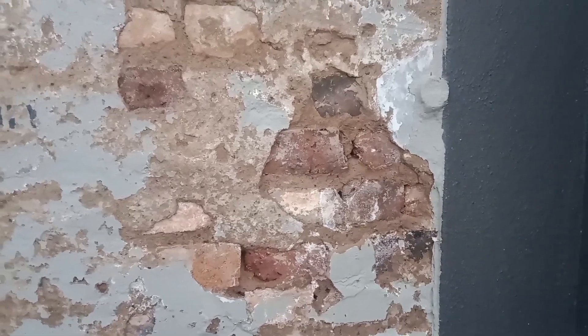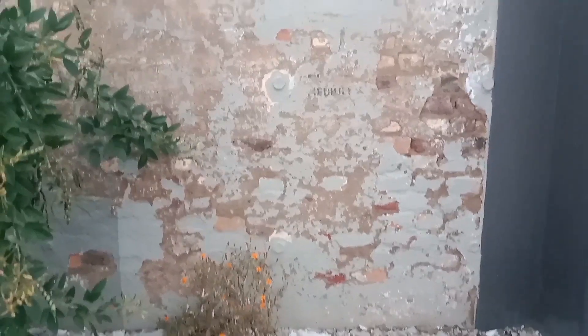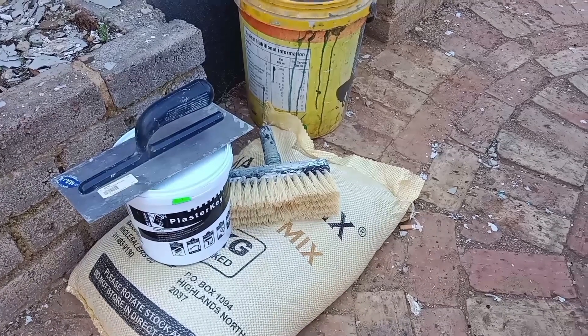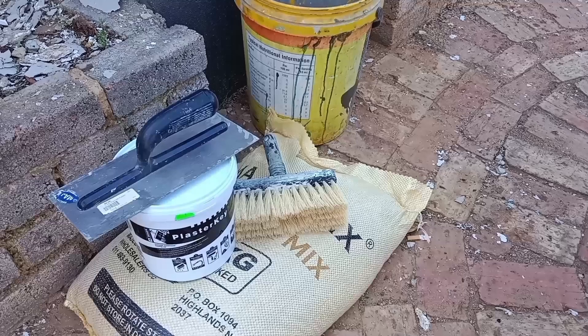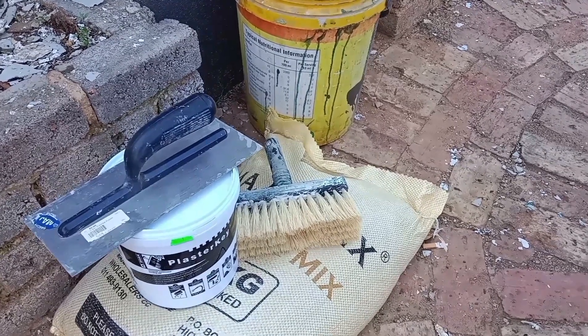With scraping came a lot more of even plasterwork exposed to brick. So we're going to want to repair these brick areas before we apply our cementitious slurry. For plasterwork, we're going to use some keying agents to mix in with our plasters so they key to the wall nicely. This is for all the deep repairs.